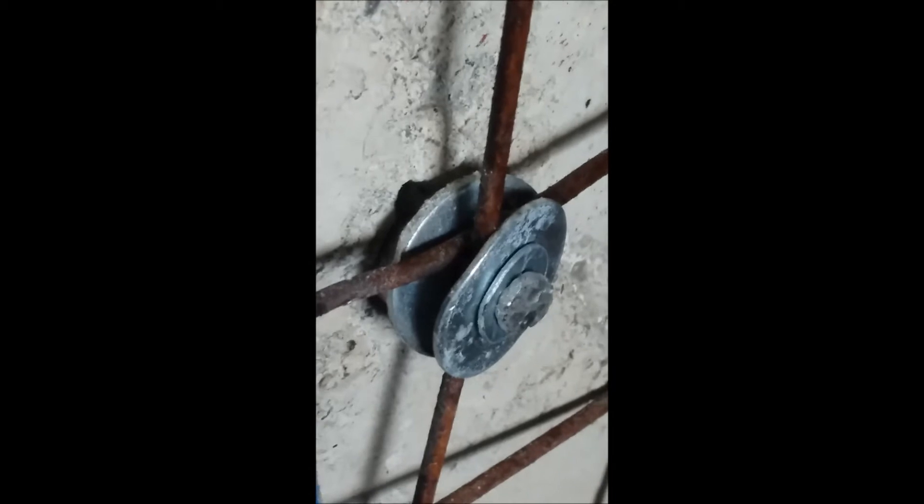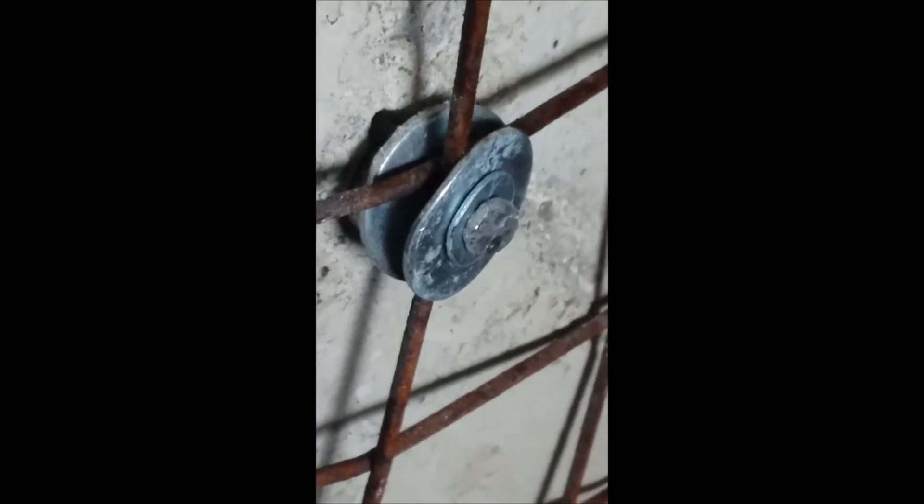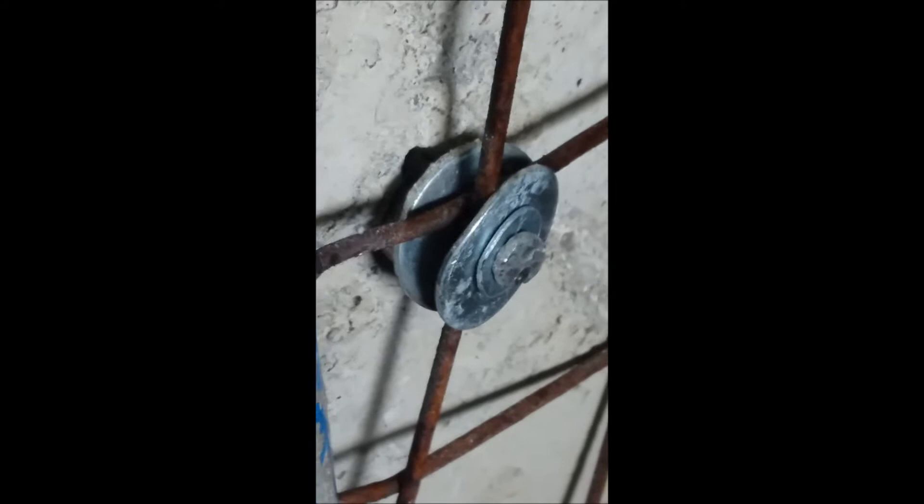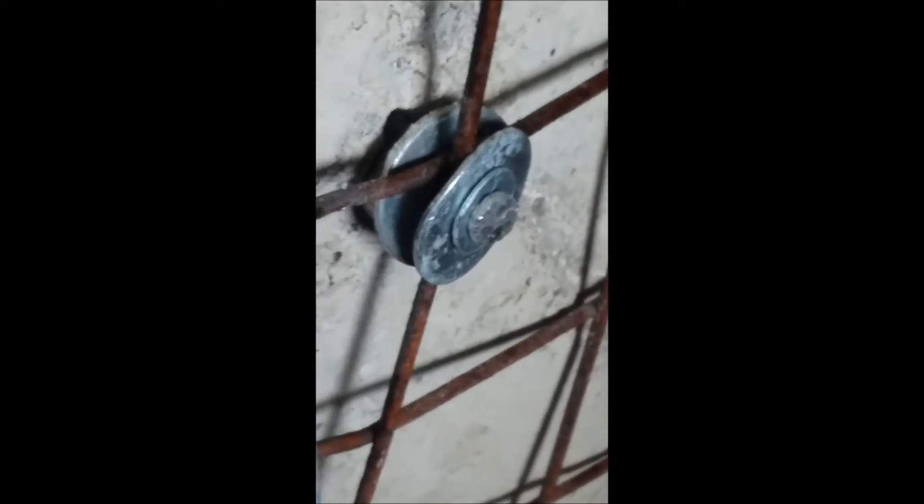This is an example of how he mounts the welded wire mesh. There's a four-millimeter hole drilled into concrete, then a concrete nail — about two inch — with a little washer and a fender washer on either side of the welded wire mesh. Behind that is a seven-sixteenths ordinary nut, which means it's US thread, and a full height nut. The edge has half-inch plastic pipe temporarily spread around it, acting as a guide to make a smooth curve, because the concrete itself is not a smooth line — it's faceted.